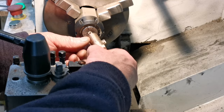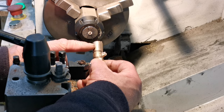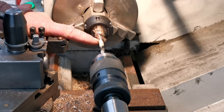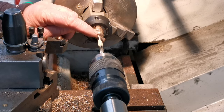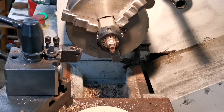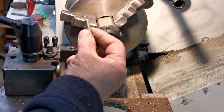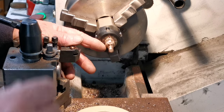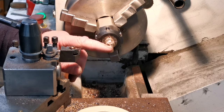Perhaps what I'll do is mount that in the lathe and part that off, and start machining this piece. What I'm going to do is drill that — I've got some quarter inch bronze rod. I'll silver solder that in and then re-drill the holes. So when I've done that I'll get back to you. So I've parted that out and I've found some bronze. I've cut a piece off long enough to go right in there. I'll silver solder that in now, and then we'll have to re-drill the holes. So let's get that silver soldered in.